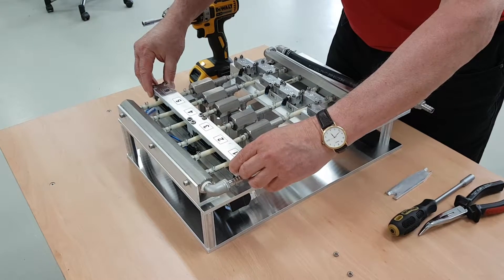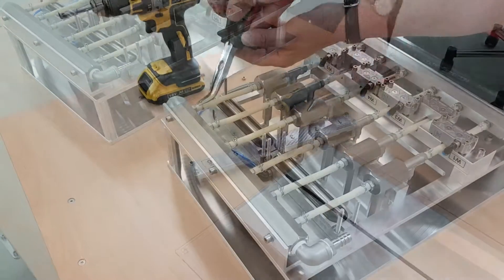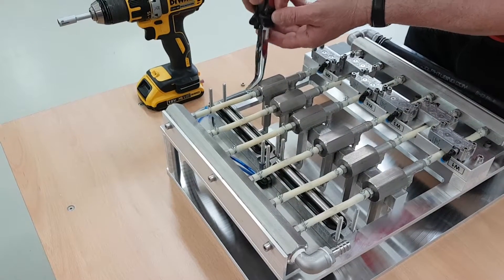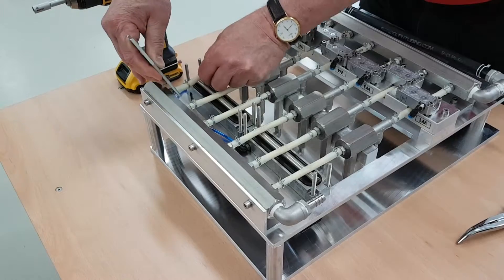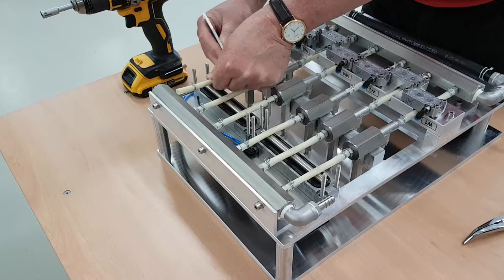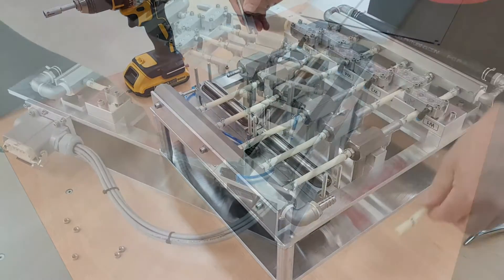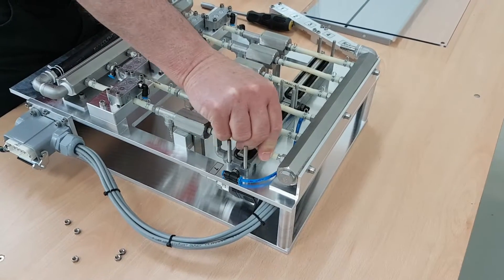All of the valve hoses can be conveniently replaced on a separate table. The pinch valves are easy to dismantle for comfortable access to the tubes which need to be replaced. They are dimensioned for the use of inside PTFE co-extruded thermoplastic tubing, which has superior chemical resistance, is extremely flexible, and resists adsorption of aqueous fluids. These properties extend their lifetime considerably and make them very easy to clean.